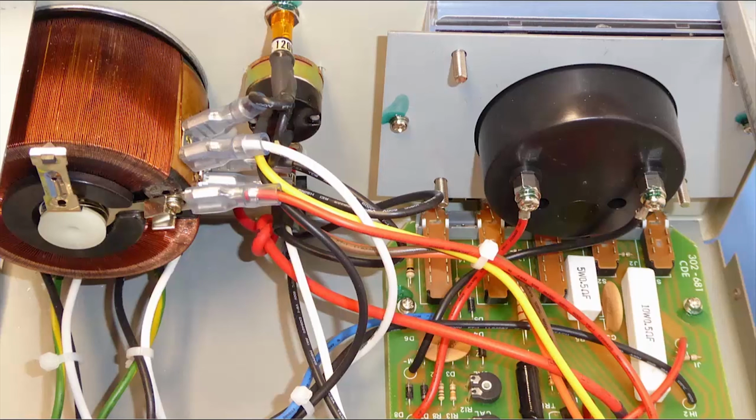But a complete fail is the so-called strain relief for the leakage probe wire. Even though I've seen this many times, I don't like the method of tying a knot in the wire. Even worse, the knot is in the wrong place, and before it does anything, the wire's solder connections are definitely being strained. It's easy to fix, to move the knot closer to the front panel, and you don't have to unsolder the connection. But for me, I will be adding a proper strain relief.